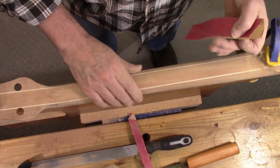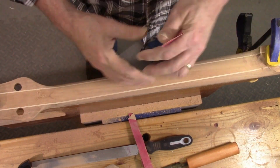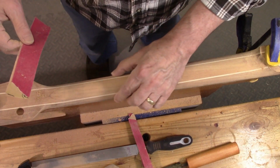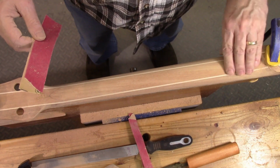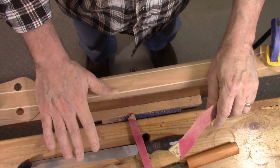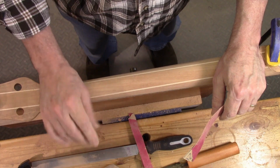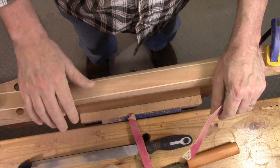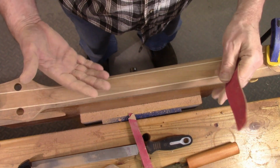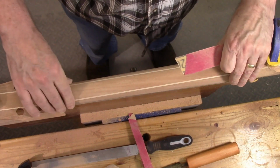That's not quite finish ready, but it gives me a really good sense of the feel in my hand when I take it off the jig, and lets me really feel any low spot, high spot, anything that I need to come back and touch. Generally I'll let this sit for a few days. Wipe it down lightly with water, not soap, but just a damp paper towel. It raises the grain so I can get it smooth, which is a finish prep technique, but it also, again, lets me really feel and see any high-low spots.